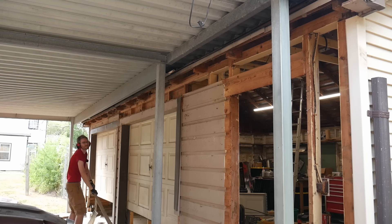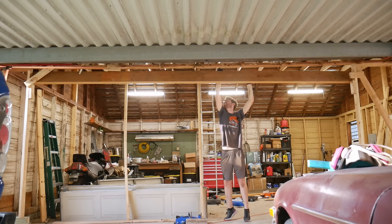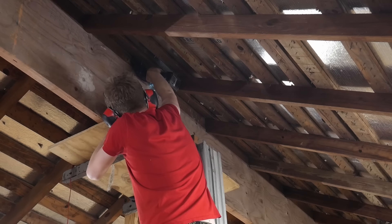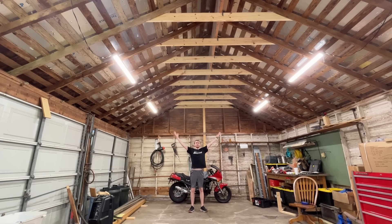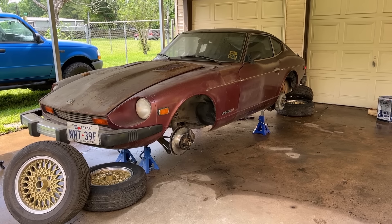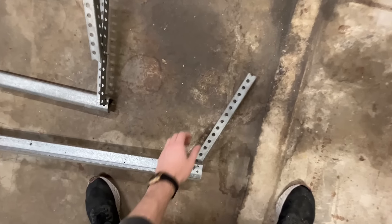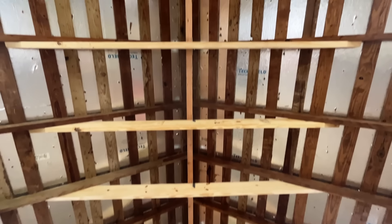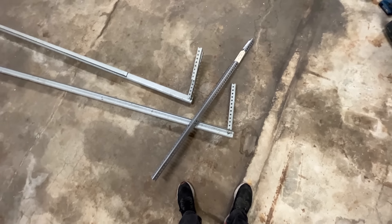Because not only will I tear it down, but also build it back better than ever, and ideally not die in the process. In a previous video, I installed a ridge beam in here so that I would be free to tear down the rafter ties and maximize headroom. But doing so meant removing the horizontal sections of the garage door tracks, rendering the doors inoperable and forcing me to work outside — which is where weather is. The specific reason these doors haven't been able to open for the past eight months is that the hangers for the tracks attached to the rafter ties are just much too short to reach the new, higher-up collar ties. But after months of deliberation, I finally figured out a solution: longer hangers.